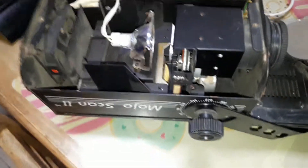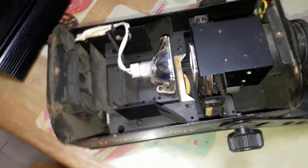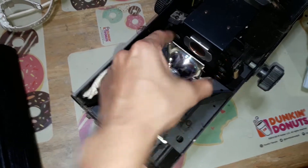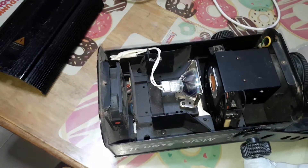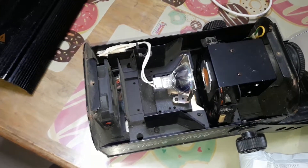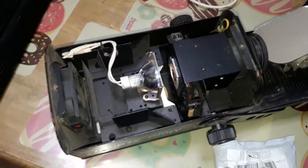This one is the innards and this bulb is busted — we're going to replace it. So the plan is we have to remove this bulb assembly with this metal bracket and install a heat sink. Some guy on YouTube did it. The heat sink we need to use is the one we can get from old computers — old Pentium LGA processors with a fan to dissipate the heat from our high power LED.